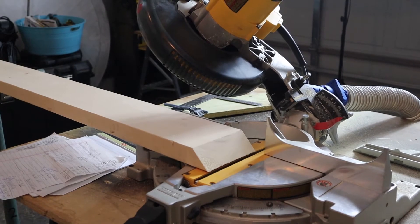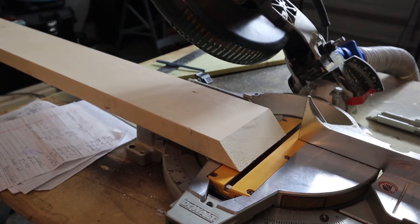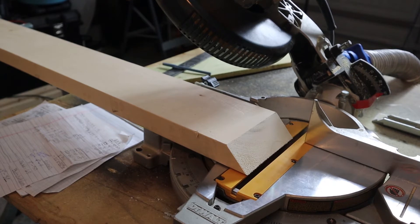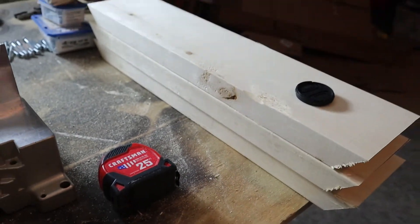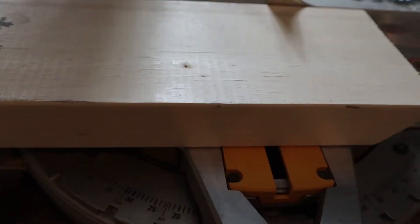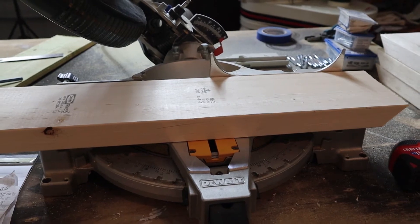We've got that three-layer cake of a workbench — let's get started with the frame. I've set up the chop saw on a 45-degree angle. First working on the apron, and we'll also call it the skirt at the very bottom of the workbench. What we're going to do is create 45-degree angles — think of like a picture frame — and use it around the bottom. With each cut I want both ends to go in. I've already cut the piece before and we'll pull it out to the right side, measure it, and adjust the saw blade manually so the final cut length is 24 and 3/8 inches.